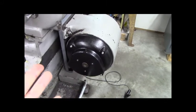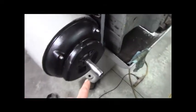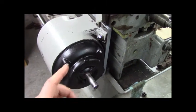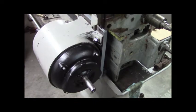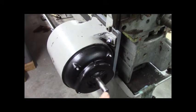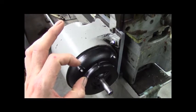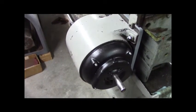The rotor bearings — the one I cooked out on the shaft side from taking the pulley off, the grease turned into like tar. It melted and re-solidified into something the consistency of tar. I had to use the propane torch, just warm up the grease to liquefy it and let it drip out. While the bearing was hot I put it in lacquer thinner, and while the grease was hot the lacquer thinner stripped it clean. Both bearings are immaculately clean, still in good shape — about 100mm or 4-inch outside diameter, 35mm inside diameter, roughly an inch wide. Big, husky, open bearings.